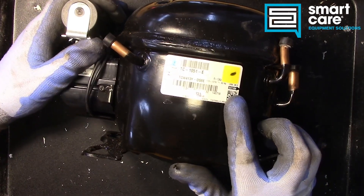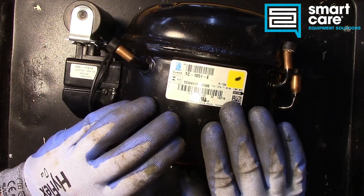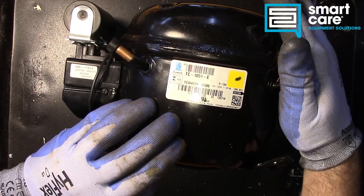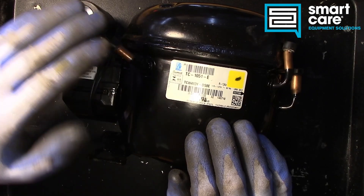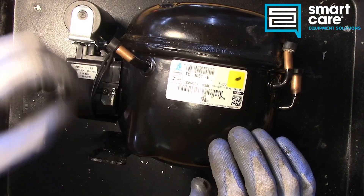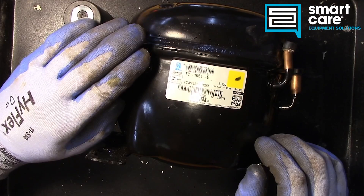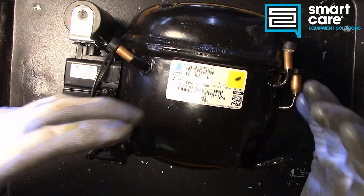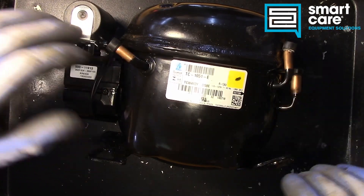The label tells us which side is our suction side. It's important to remember that compressors operate on vapor. We pull cold vapor in on the suction side and push hot vapor out on the outlet side. That hot vapor then goes through a condenser to pull more heat out of it and return it back to a high pressure liquid. So we have a high pressure hot vapor outlet and a low pressure vapor inlet. One of the easiest ways to damage a compressor is to feed liquid into the suction side.